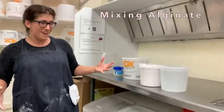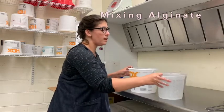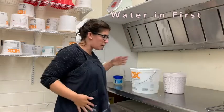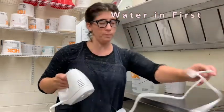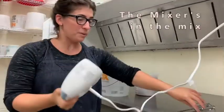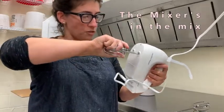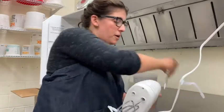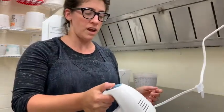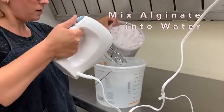One-to-one is not an exact science and that's fine. I'm going to take my water bucket and pour that into my mixing bucket, then set it aside. I'm going to plug in the electric mixer — not a drill, an electric mixer. Put in the little mixing blades: there are notches in the blades that line up with notch holes and it will audibly click to lock in. You want to hear that click, otherwise the blades will fly across the room when you turn it on.